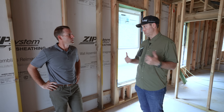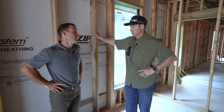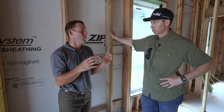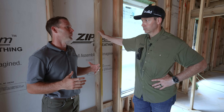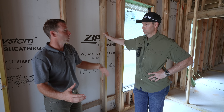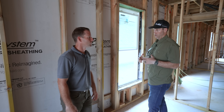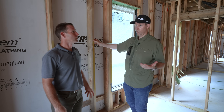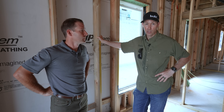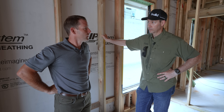I'd like to point out that you did all the other waterproofing details really well. You're seeing that he's using zip system stretch tape. He put a rip of zip down first to act as a back dam. He's going to do a backer caulking or backer spray foam on these windows. Big shout out to your architect — the architect on this project is Passion Home Design. They're really great. The architect is very knowledgeable on the building side and even included insulated window and door headers on the plan. He also put a good overhang everywhere in the house, and by having that overhang it's that much more forgiveness for a house like this.